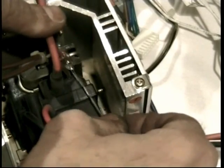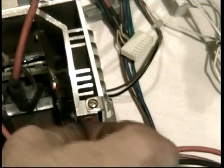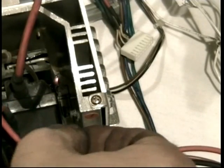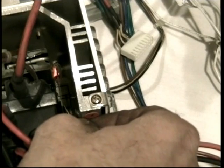It's really pretty cool. All you have to do is hold the neon lamp against the flyback transformer, and it will glow orange. Typically, you hold it near the core of the flyback transformer, and it glows orange. If I hold it down here, it'll really glow. Can you see it glowing? I'm just holding it up against the body of the flyback transformer, holding it by both the leads. I'm not getting a shock. It always works best if you hold it right up against the core. So that tells me that I have high voltage, that it's on and it is continuous.